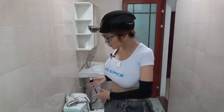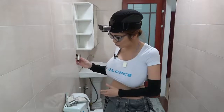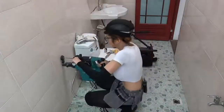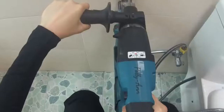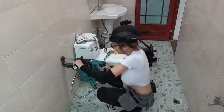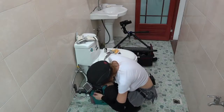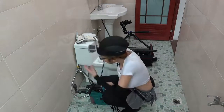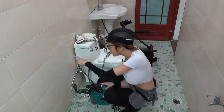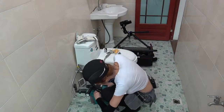While that dries, I'm going to mount this bracket on the wall to hold on to the nozzle. I'm going to switch the drill mode to the hammer mode. Obviously when we go through the tile we don't need the hammer mode, but for the concrete behind it we definitely need to use the hammer mode, so I'm going to switch it now.